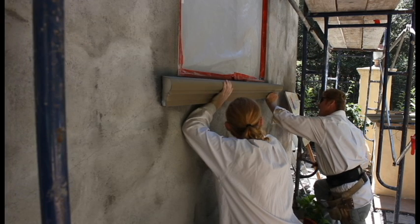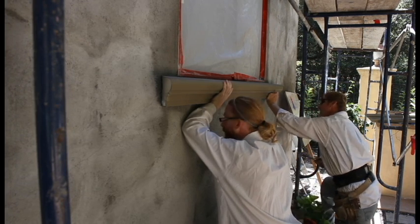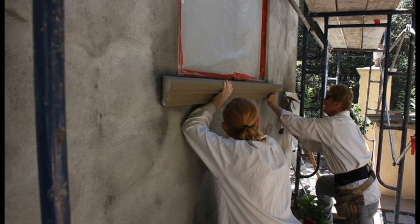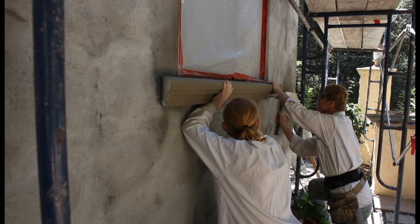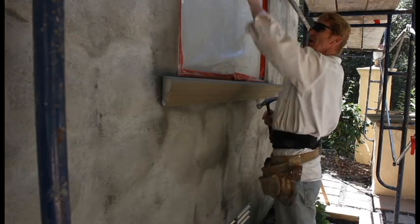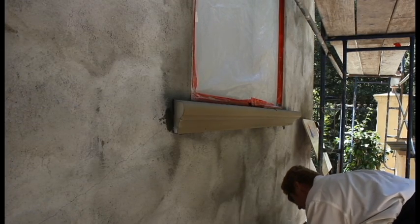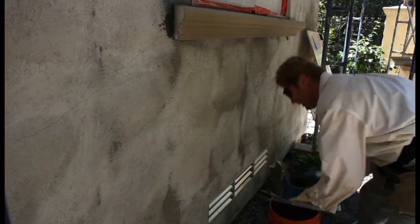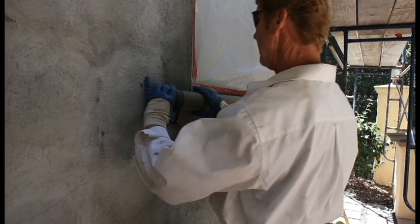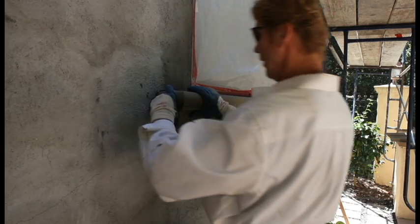I'm going to put my second nail right here in the stud. My nails are long enough to penetrate the styrofoam, penetrate the inch of stucco, and still go into the stud about two inches — that's what I want. And if you don't hit it straight, the nail will bend. Now we're going to stick these sides in. Just slide them in there — I'm not going to nail these guys. I'm just going to get it where I need it, squeeze it in there and get all that excess poly bond out. We want excess — we want it squeezed out just like that.